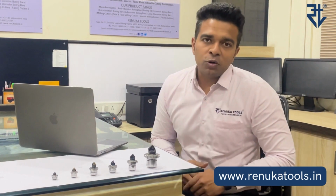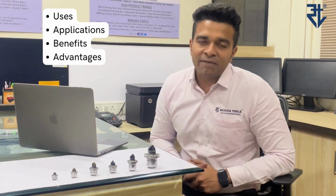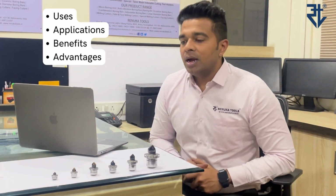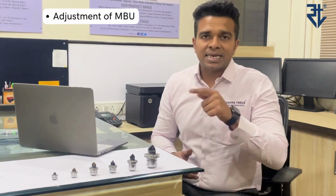So what are we going to do in this video? We are going to talk about its uses, its applications, its benefits, its advantages. We are also going to talk about how can we adjust them in microns. The least count of these units is 1 micron radially. So we're going to show you that on a presetter.